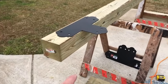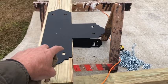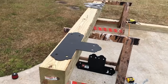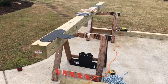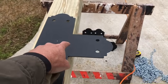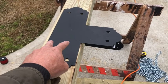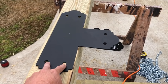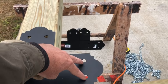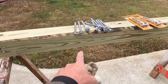I think the key point — and I've noticed this with a lot of people — is that the stress point of the swing set is at the top beam junction, with the weight and momentum of the swings going back and forth. So I went ahead and got these plates — they're about $20 each. I'm gonna put these on the front and the back, bolt them in, and use the anchor bolts here as your connection points on the post.